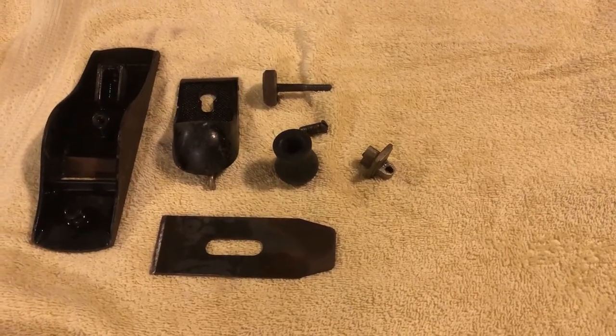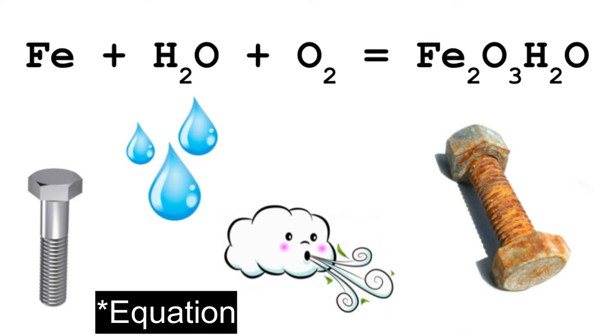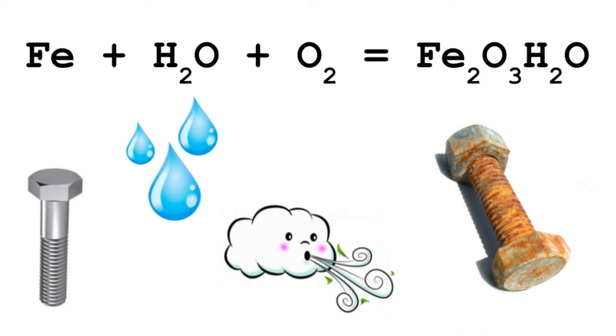Here's everything after the bath and you can see we've already had a huge improvement. Now, why is it a bad thing to mix rust with water? Here is the chemical compound that shows how iron rusts: when you combine iron with oxygen with water, you get iron oxide — aka rust. The iron is always present because it's in the metal, and oxygen is always present because it's in the air. The only thing that's not always present is water, so by adding more water we increase the speed at which this reaction occurs, causing things to rust faster. That's why people say it's bad to wash something rusty — however, it doesn't really affect me because I'm going to be removing all of the rust anyway.